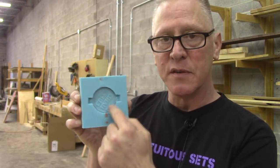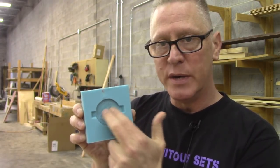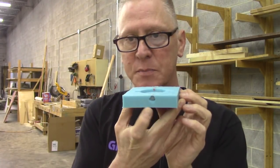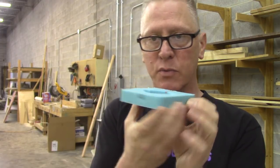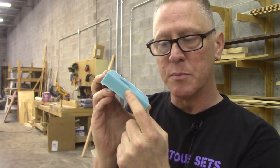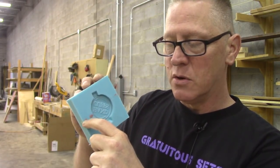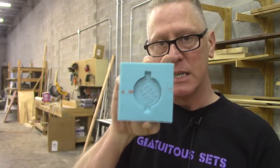And you can see I've got my surface detail. I've also got most of the edge so that can hold the coin in. And here's my injection hole. The little resin plug is still in there, the little resin taper that we made. And that is the exhaust hole, or part of it. The rest of that exhaust hole is actually captured within this first half of the mold. And the same thing is true for the injection head. So that is a clean little guy right there.